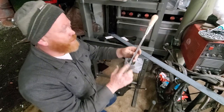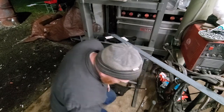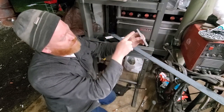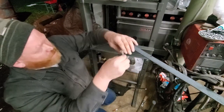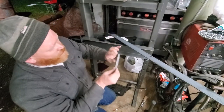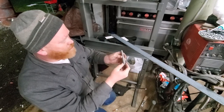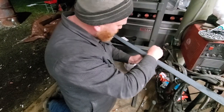I'm a little on the lazy side — I have eight holes to do with these carriage bolts. What I did is take one of those files, used my calipers to make sure I had plenty of room past the taper. It's tapered so it'll fit into the round hole. I measured back using my calipers to make sure I had plenty of room for the half-inch section to go in and tear out the metal. This is the first hole I've done with it and it turned out perfect.